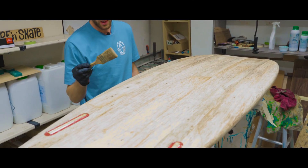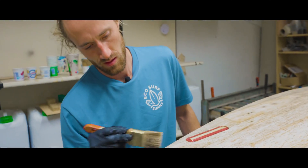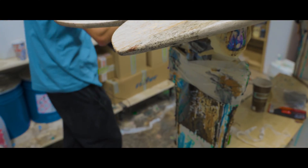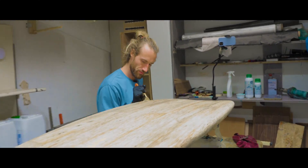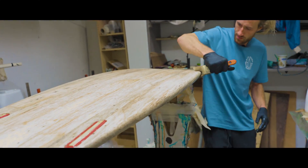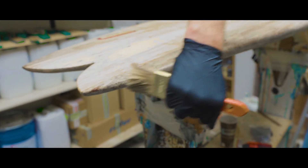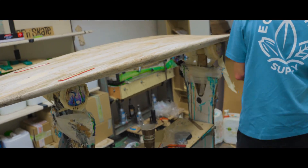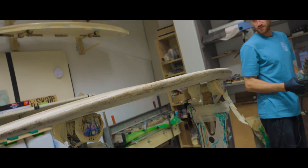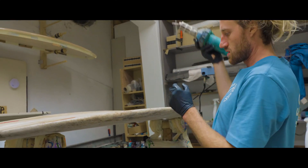We can go over the rail one more time with a brush - if there are any epoxy noses or leftovers, we collect them and push into the grain. Now the fast epoxy is also getting a bit sticky. As the next step, we plug in the heat gun because we want to have the epoxy sinking much more into the rail, so we heat it up.